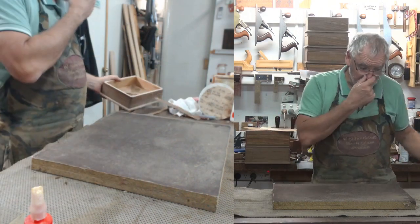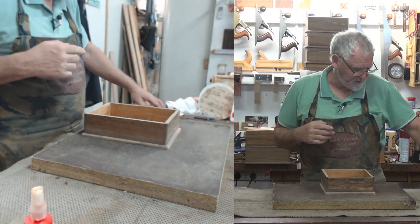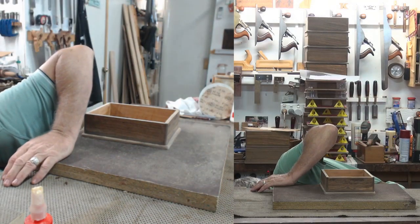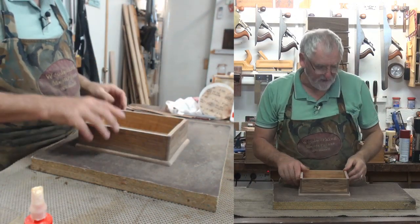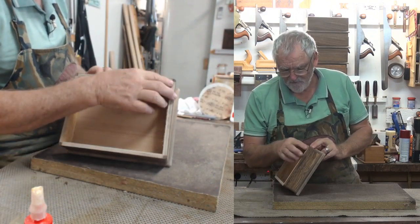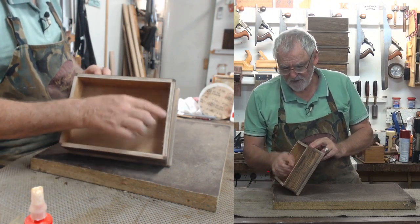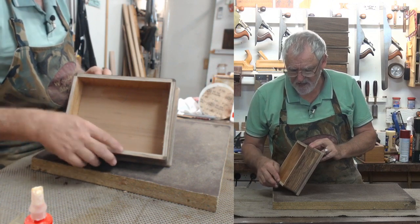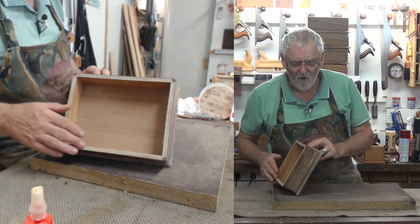If you go to big kitchen shops, they have huge drum sanders or belt sanders or conveyor belt sanders, and you can generally pick up one of their used belts and it still has enough meat on it to do what we need here. So these we cut off, if you remember. Got to get used to this camera over here. Cut this off on the saw, but we left about 0.5 millimetre so we didn't get a bite. So if there's any raised veneer, just knock it off with a chisel or a knife. And now it's not quite even.